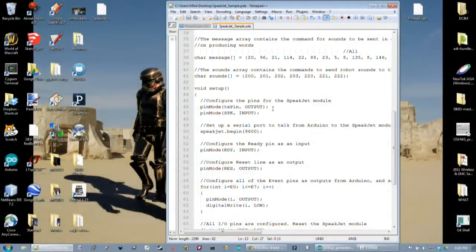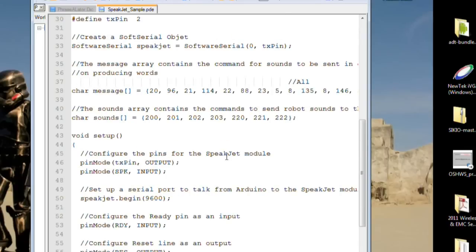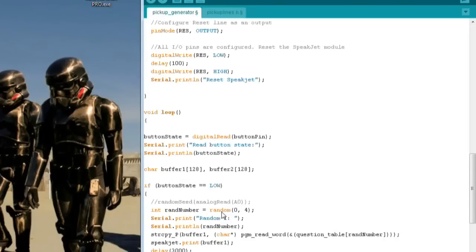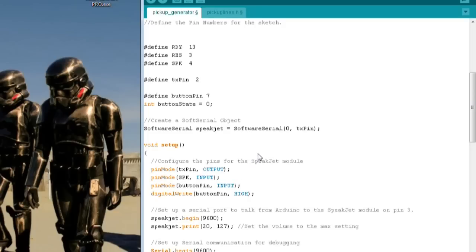Mike has pulled up here on his computer the example code from the VoiceBox Shield page. So you can always check that as well. Try loading that code up to see if it's a circuit problem or if it's your code. So there are different ways you can troubleshoot that. We can keep digging into this, and if we do find a fix for the code, we will get that uploaded to GitHub for you guys, along with the fixed Fritzing diagram. So, have any other last minute things there, Mike? No last minute advice for getting this working. Yeah. Certainly we will dig into this a little bit and see if we can figure out exactly where it's gone wrong.